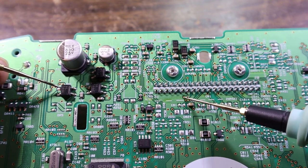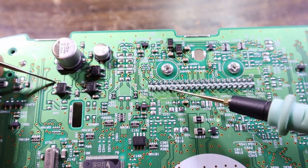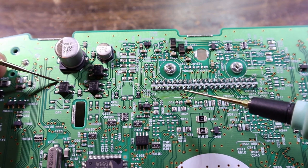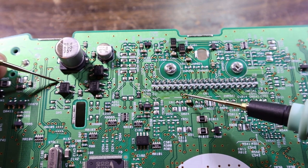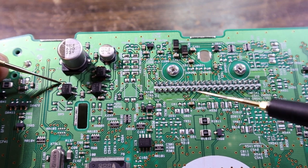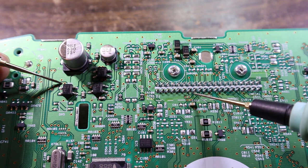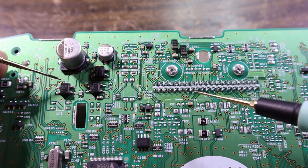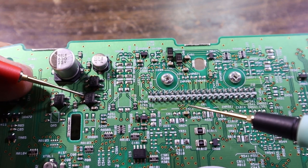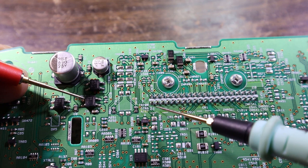And it's got two wires going through. These ones have two wires coming up, so it's a nice heavy power trace. So we'll say that that's that. Checking, of course, that it is 0 ohms, or less than 1 ohm. Otherwise, if it was like 50 or 100 ohms, it may not be the feed in. So just be careful. And then on the next diode package over, we're going to probe on there and run along again.